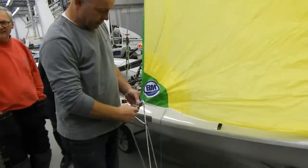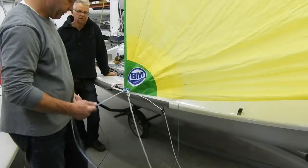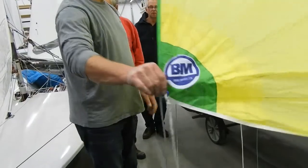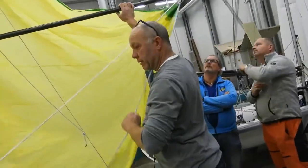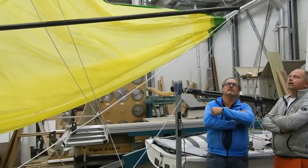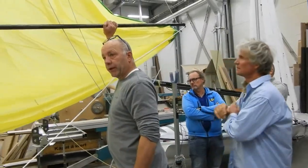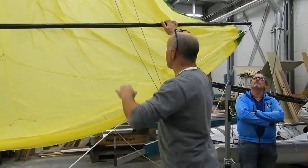Because then the pole is away from the forestay. This sheet is tapered, so you don't have the fat end here and not a fat knot. This goes to the forestay and this is too long — it should stop here. It makes no sense to have this too long and the pole being able to go that way. That's because you changed the knot — so you adjust that to the proper length, so it goes out and stops at the forestay.